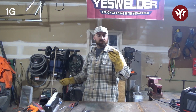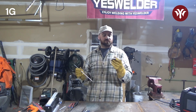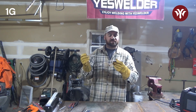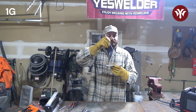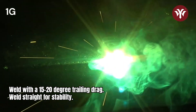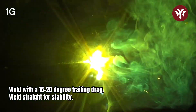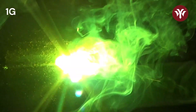A groove weld — I'll just use this piece of flat plate — is going to sit flat whether it's in your vise or on your bench. This is a very basic weld, one of the first that anybody practices. It runs flat with a 15 to 20 degree trailing dragging angle. Just run it straight across; you might do a little bit of a weave to keep yourself steady.